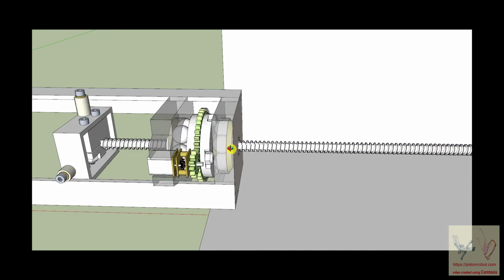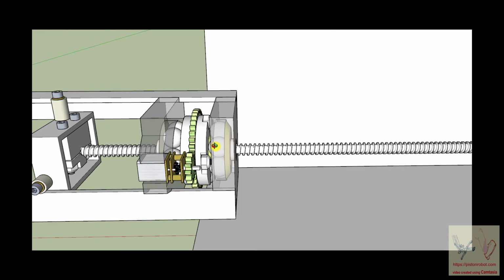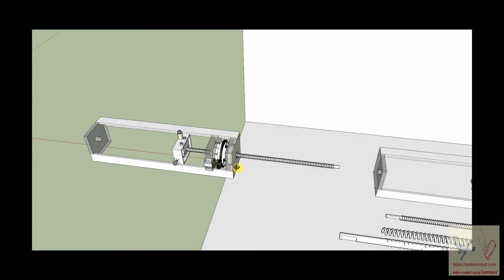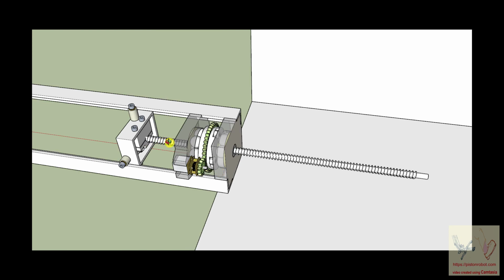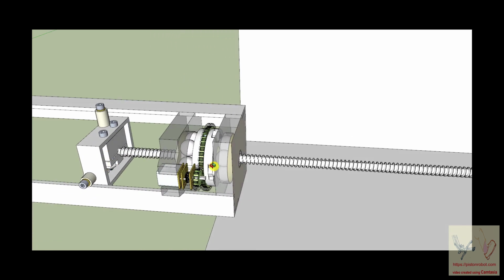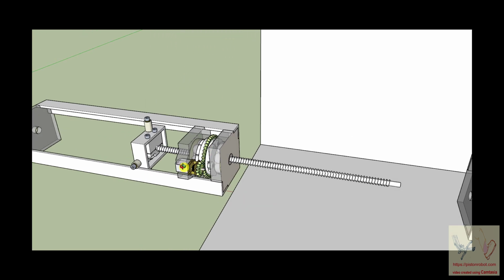A metal insert set into plastic, where the balls of the ball bearings are rolling against metal, but the metal is set in plastic. So this whole structure would have a metal ball shaft and a metal ball nut, and metal gears, a metal gear motor, and the metal of these nuts and bolts, but all the rest of it would be plastic. And it was my hope that this would allow for the price to go down.